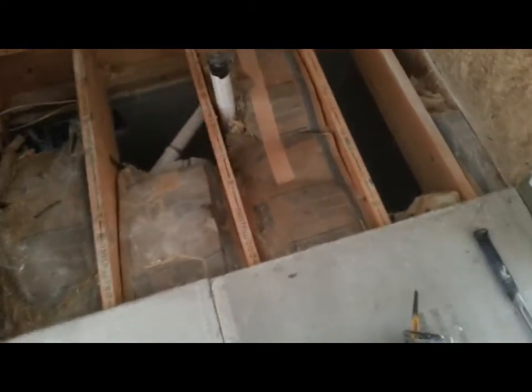Alright, phase one — we've cut the subfloor out and put the cement board down inside the room. You can see we've got the thickness of the underlayment plus the thickness of the quarter-inch cement board. The outside of the shower gives us about an inch and a half, and on the other side we're going to run the TI Pro Board across the floor joists. We'll run a nailer strip along the leading edges where the traffic will be going from the main floor into the bathroom floor, to take the extra load.